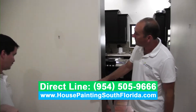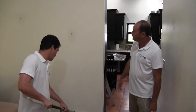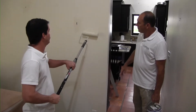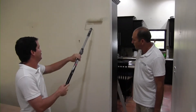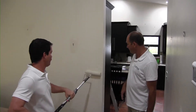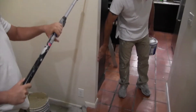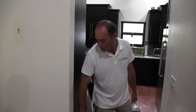So now we're going to paint here. This is eggshell. We're going to do two coats — so that's the first coat. We got to wait at least 40-45 minutes to dry before we do the second coat. And then those spots here, we're going to do a primer before we do the top coat.